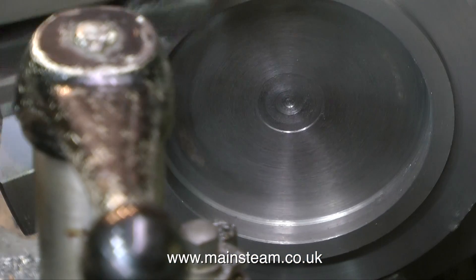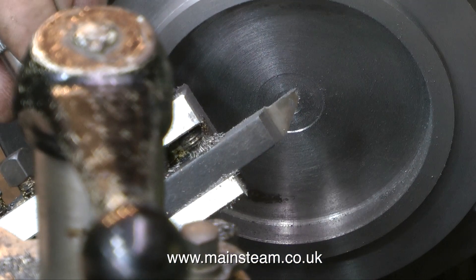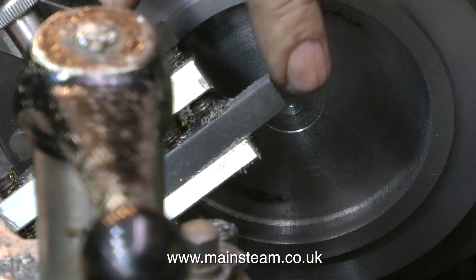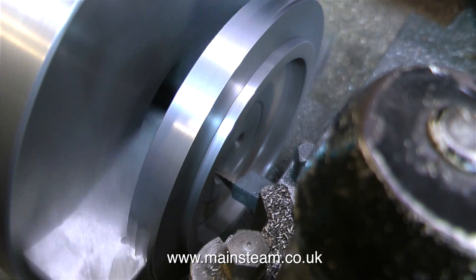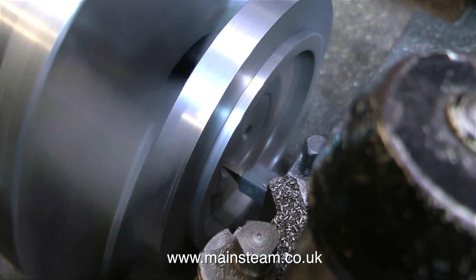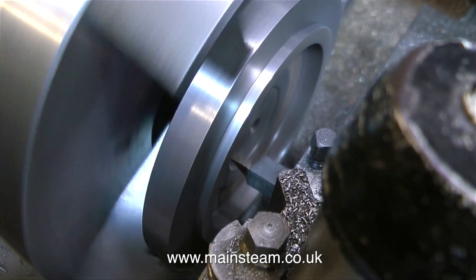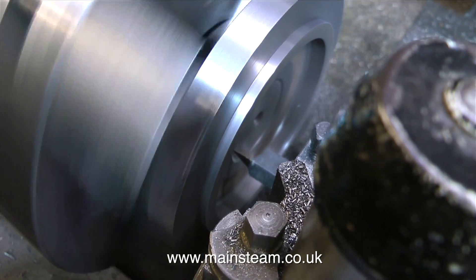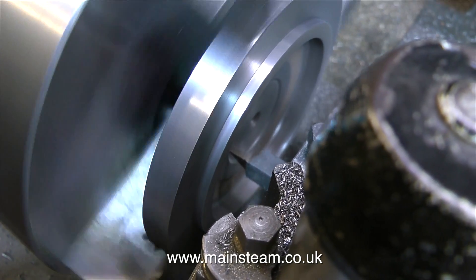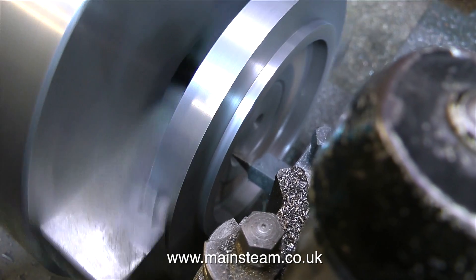Because of the shape of the casting in the chuck, I can't use a micrometer, so I use calipers — low-tech but very accurate if used properly. I've got plenty of scope for more machining. My modified parting tool is not very strong, so I have to be careful, and I need to hand-hold the camera above the lathe to film it. The high-pitched squeaking is the thin tool vibrating.